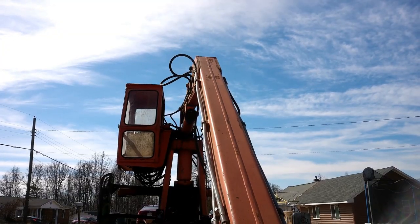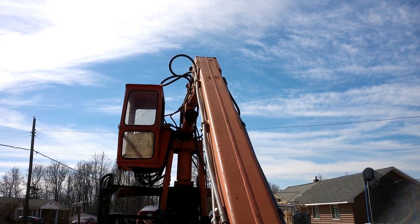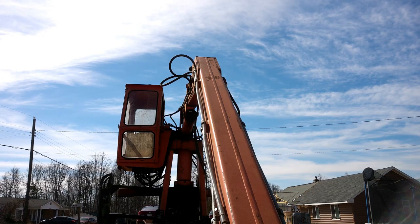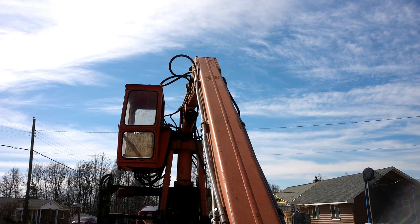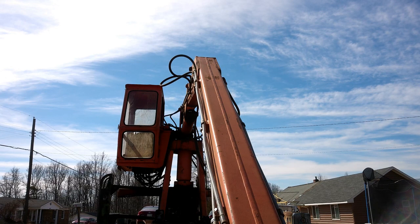This is an old Prentice H model knuckle boom loader, and the packing seals that I have for this, according to the book, the same packing will go in a Prentice 410C knuckle boom loader. So if you're looking for the numbers on the packing, if you also have a G model knuckle boom, this packing will also fit a G model as well, and I have some information in the description.